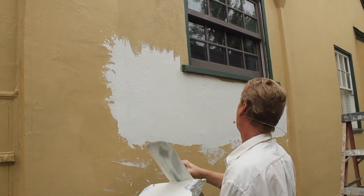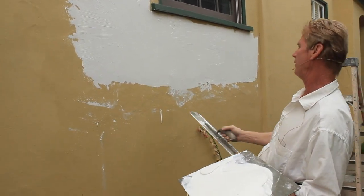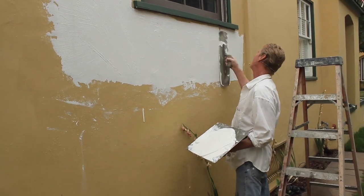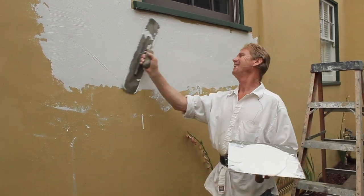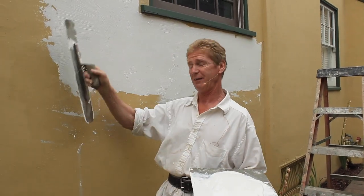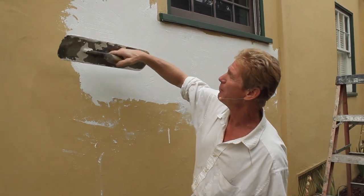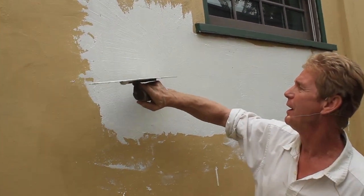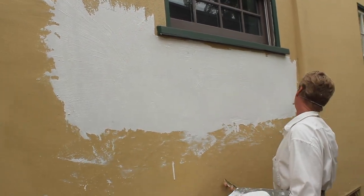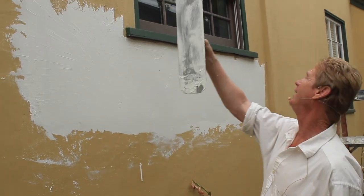Give it a little bit more. Now if I left this too smooth, you can see this has bumps and craters, so I'm just going to go over this. You just go over it and get rid of the sand grit — that's the idea. On the sides here, you want to put your blade half here and half there. That gets rid of the transition, guys, and when this dries it won't crack either.